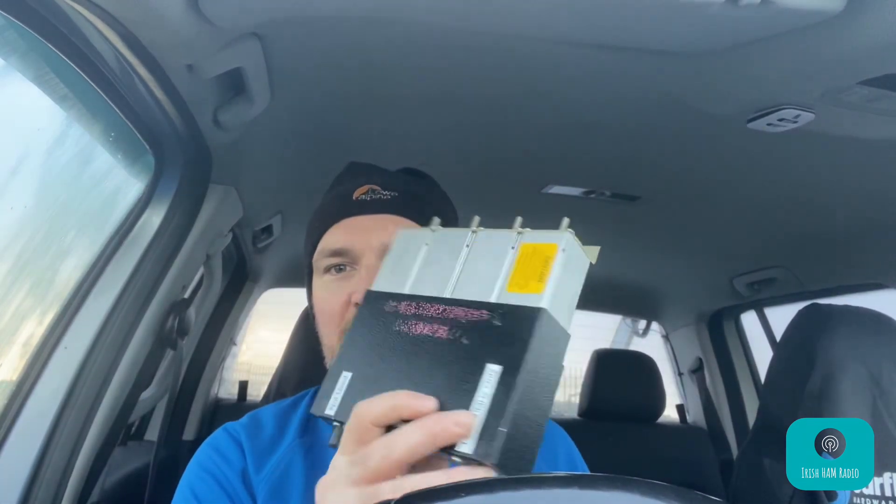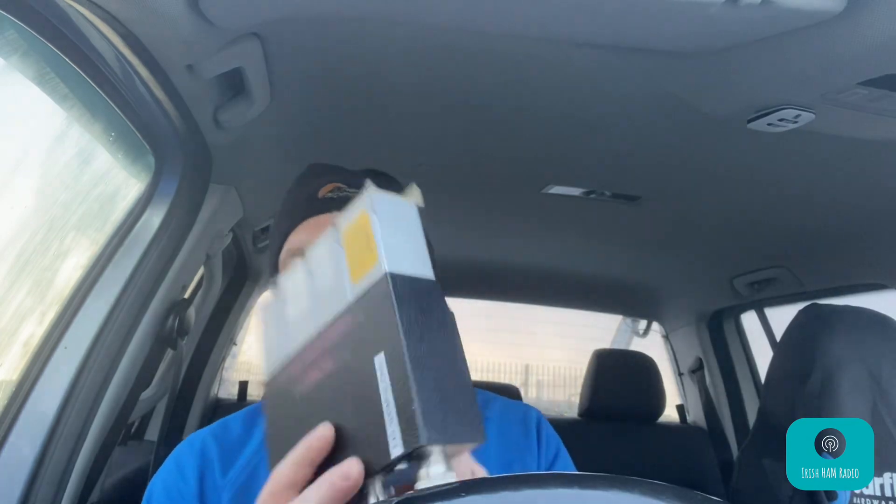Now, I didn't get to that stage yet with my skills, but it's actually not that difficult — when you look at his video it shows you everything you need. It's more nearly a time thing with myself. Anyway, inspired by him, I realised I had a number of old VHF duplexers sitting around. So I decided I'd retune one of them. I'm no expert in retuning these cavities, so I basically used an SWR meter and twiddled with the adjustments to tune one side of it to a simplex frequency of 145.500, the FM 2-meter calling frequency.